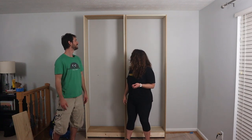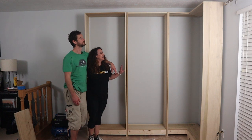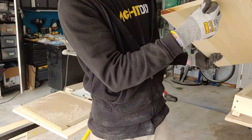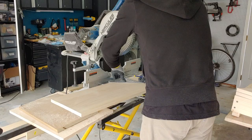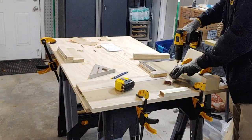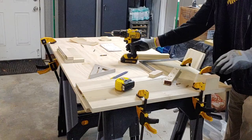One more — the corner unit — and mildly more challenging. Here we use the finishing blade with the two-pass technique to cut the corner unit's top and bottom out of the 1x12, meeting at 45 degrees. We clamp them down in place, set some 1x2 brackets down, spaced well enough with 2x4s to make sure we can set the frame in place, then drill and screw it. We did this for both the top and bottom.